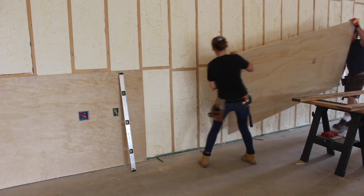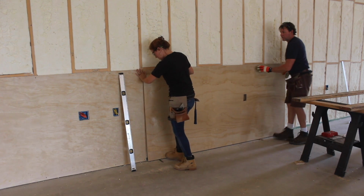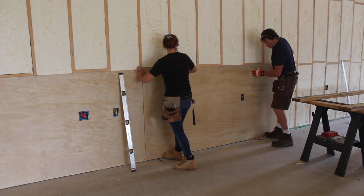Then when actually placing it on the wall, we would lay down 2 carpenter's pencils for the spacing, then butt it up to the previous board and secure it to the studs with screws. A nailer would definitely speed up the process here. However, I stuck with screws to make taking down these panels easier in case I ever want to replace one or need access to the inside of the wall.